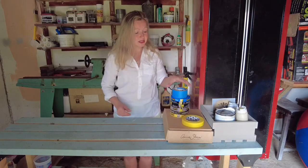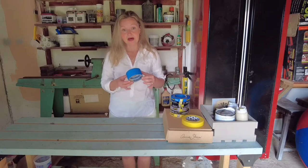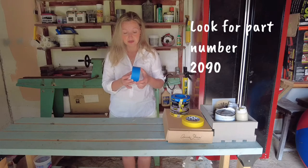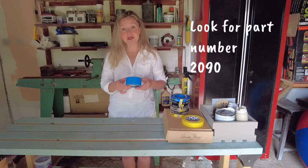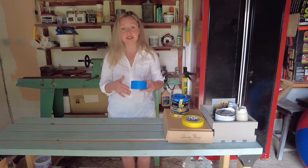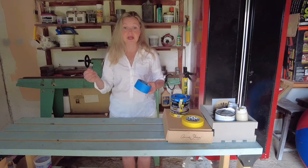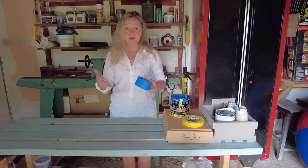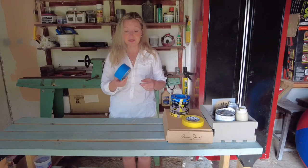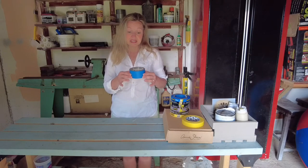The second tape is blue painter's tape. Blue painter's tape comes in a variety of widths — this is a two-inch — and it can be left on for about a week without tearing. So if you're painting your baseboards at home and you tape up the floor and the wall, you can do a couple of coats of paint over a few days without worrying that the tape will tear when you remove it. This is your basic all-purpose painter's tape.